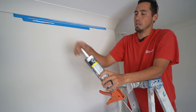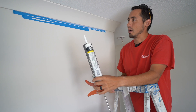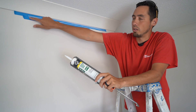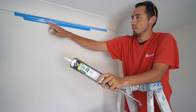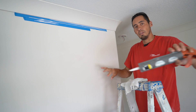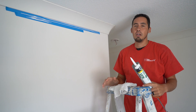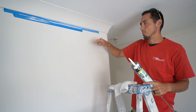You would wipe that and you'd be wasting caulking. You'd have a lot of what we call 'snow plow' — that's what I learned when I first started using a caulking gun. The guy told me you don't want snow plow, which is when a snow truck drives through and leaves a big buildup on the sides. Just imagine one of those snow-pushing trucks clearing a road with big buildups of snow on the sides. Your finger represents the plow, the caulking represents the snow. You don't want any snow plow — you want to just push it in and wipe it smooth.